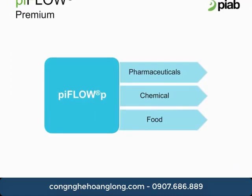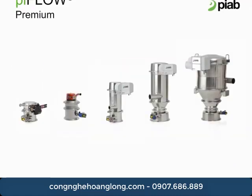Our most complete and versatile line of conveyors is the piFLOW. A very visible difference between the I and the F series and the piFLOW P is the material of construction used for the conveyor body. The piFLOW P uses a polished 316 stainless steel, whereas the piFLOW I and the F use a 304 stainless steel pickled material. The piFLOW includes robust gaskets, heavy-duty stainless steel clamps, and a modular design that makes for easy disassembly and reassembly.